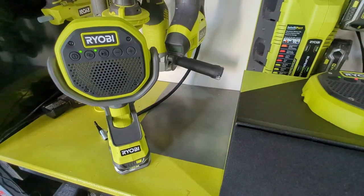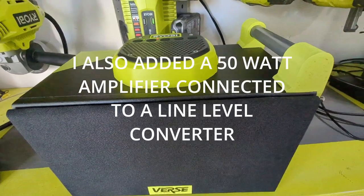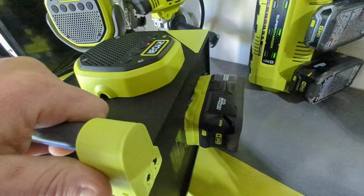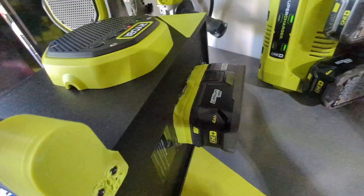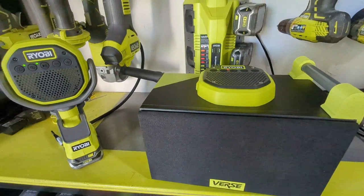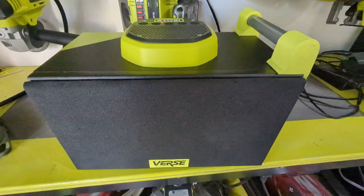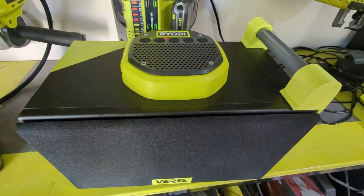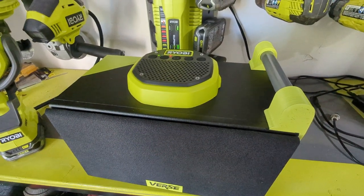If it isn't obvious by now, all I did was take one of these clamp speakers — I got a two-pack — and kind of tore it apart, hooked it up to a six and a half inch bookshelf speaker, put a handle on it, did some 3D printed parts, took the same clamp base and stuck it in there, and had the battery connector in there. It has a nice carry handle, and this thing definitely rocks a lot louder than the two inch speakers, although the two inch speakers are pretty good. Pretty cool little project and not too hard to do. If you guys really want, I can give the steps on what I did and the parts I used to make this happen, but it's definitely a good speaker — thanks for checking out.